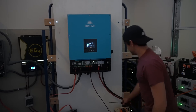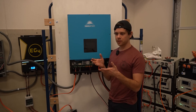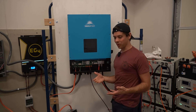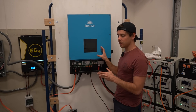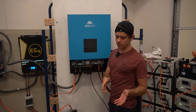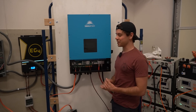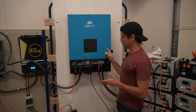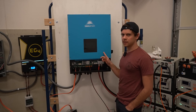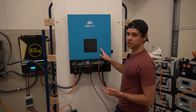I'm just going to disconnect it from the battery. Sadly, the software needs some work. I think it's a very capable unit and the hardware is incredible especially compared to the old LV6048, but the software is just plain awful. It did power the load for a long time, but to make that work took a lot of effort. The charging current went really high and all these new off-grid modes and settings — the old software and the new features are not working together. There are bugs in the software that need to be sorted out. But I like the direction, especially how quiet it is and the 550 volt PV input — that's fantastic. Unfortunately it's not there yet; they need to work on the software. If a firmware update comes out please let me know and we can do more testing. For now we're going to push this to the side because it's not ready.